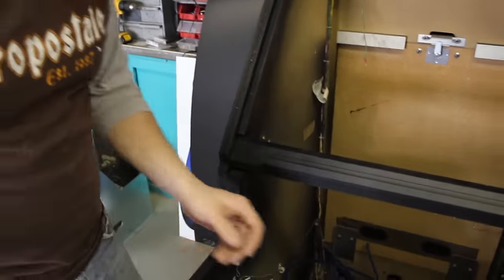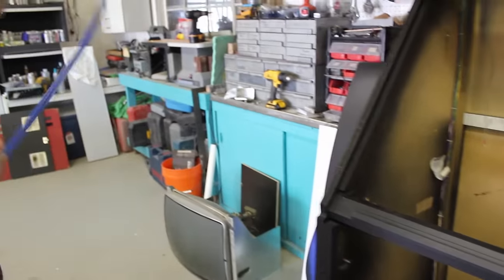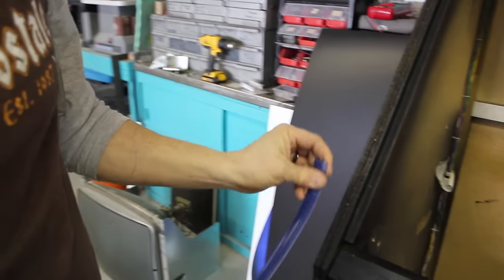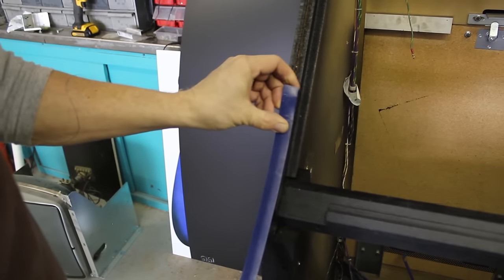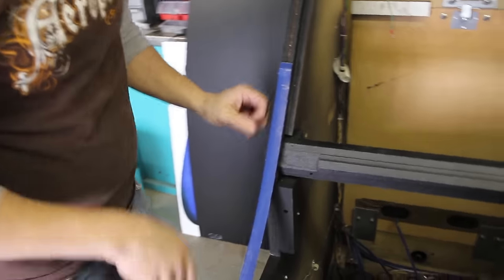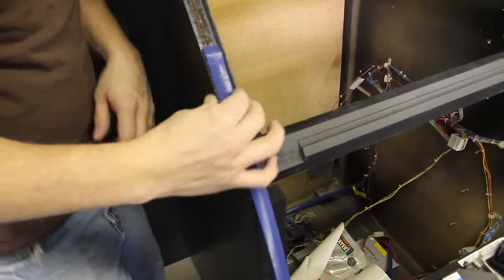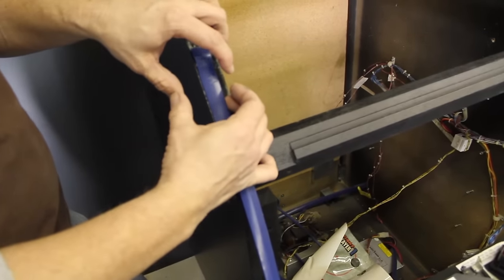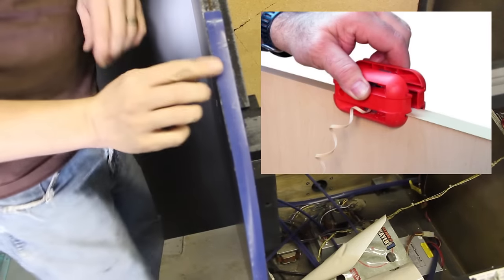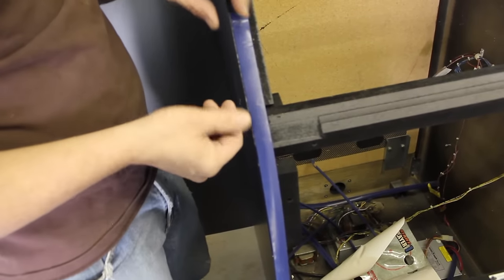Now, one of the things that you got to consider, here's an old T-molding. You've now increased the width slightly. You see, it almost will look like a board that was swollen. See how you have a little bit of this edge? So they do sell oversized T-molding, and then you would cut it back down. They have a cutter to compensate for this distance. It didn't get wider here, but it does get wider here.